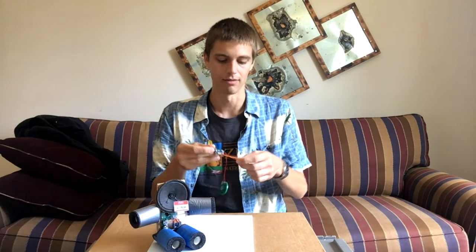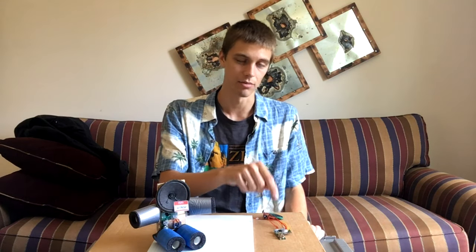So I just recorded the Wilhelm Scream and then I desoldered all of the excess pins from here, replaced the playback button with the accelerometer and linked in an analog accelerometer that's intended to be used with like an Arduino or something. And that's basically all that happens. So the accelerometer, I'm using the free fall detection pin, and I have that linked right into the switch that is the playback switch on here.